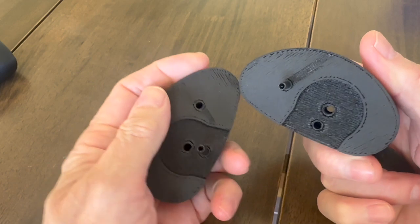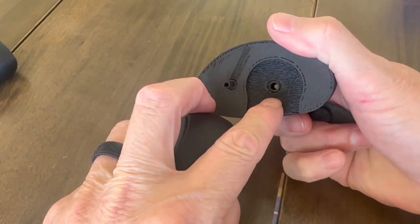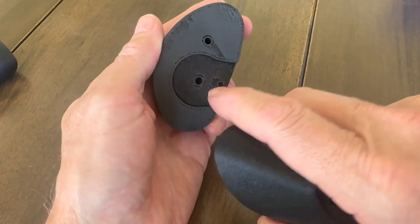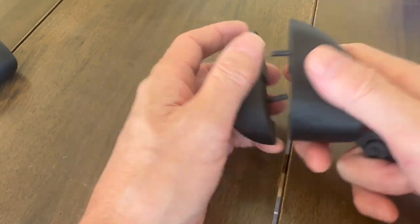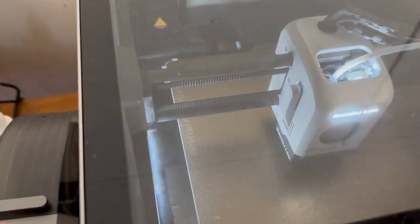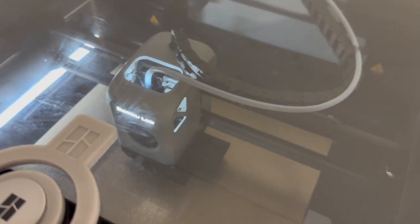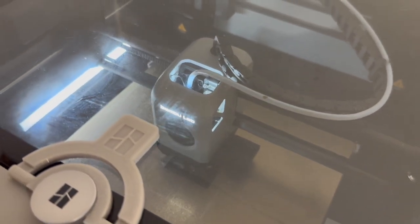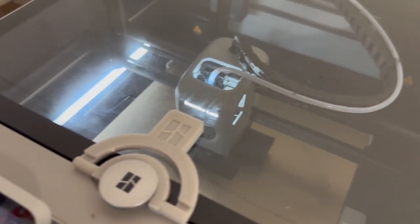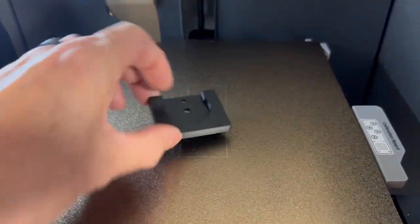Because this has a roll pin that goes in through the handle, I need some kind of jig to drill for the roll pin in the handle. So here's my new printer printing the drill jig — I'll just show you the time lapse rather than standing here looking at it. But that's basically how it works, and here's the finished result for the jig.